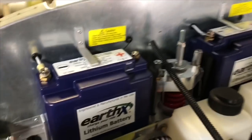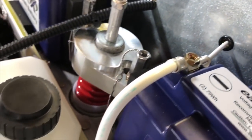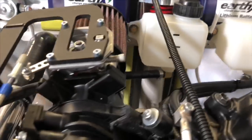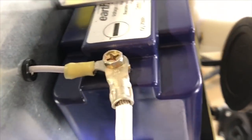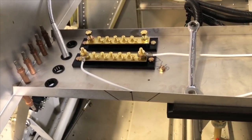This wiring is a little bit of a challenge for some. First, start by adding a ground wire from each battery to each end of your grounding bus. In addition to the number 10 grounds that go to the ground bus, you have to run a number 6 from the negative side, strain relieve it to the airframe, then bring it onto the engine, strain relieve it again, and then bolt it to the engine. We'd like to do that on both batteries. These are to carry the starting current when the engine's cranking. So from the negative side, strain relief to the airframe, then bring it to the engine, strain relief to the engine, and bolt to the engine. So there's a total of four ground wires — two large ones to the engine and two smaller ones to the airframe for all the stuff that goes inside.